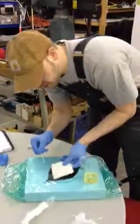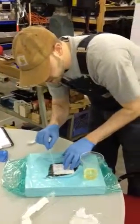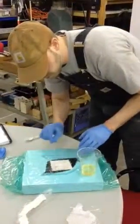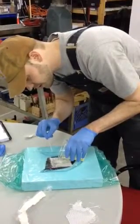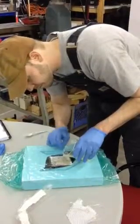And now here's biaxial mat. We laid epoxy that we mixed up, in this case 4:1 thin, on the carbon, and then smoothed it out, wet out the paper, wet out the carbon. And now we're going to wet out the biaxial mat, and it takes a little more epoxy because it's thicker. It's almost like a cast if you broke your arm.